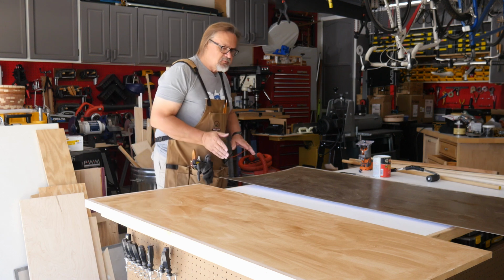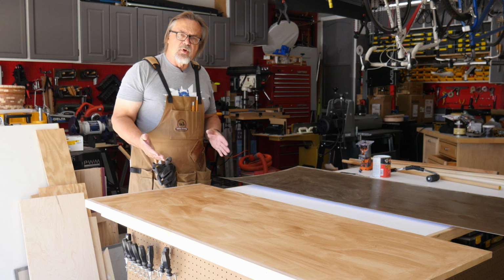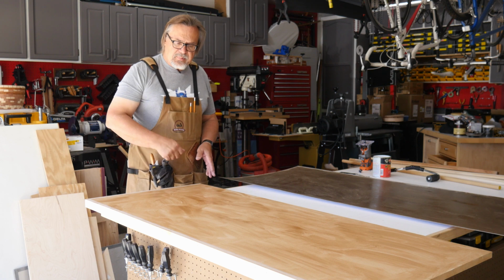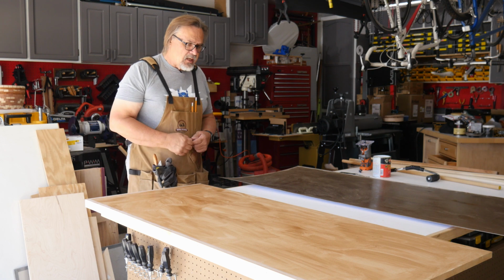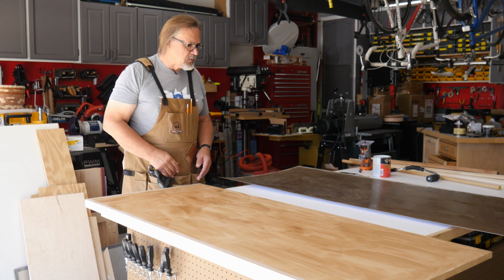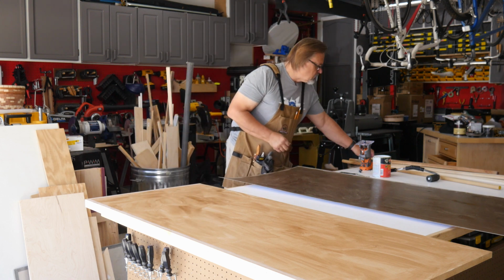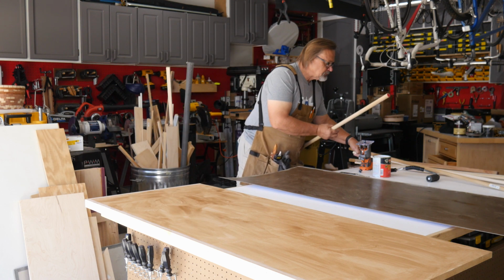Okay, so it's been about 15-20 minutes and both surfaces are pretty dry. Now, if you let it over dry, you can reactivate it by just applying another coat. Sometimes with some wood, very porous material, you're gonna have to apply 2 coats, but I've never had to do that yet.